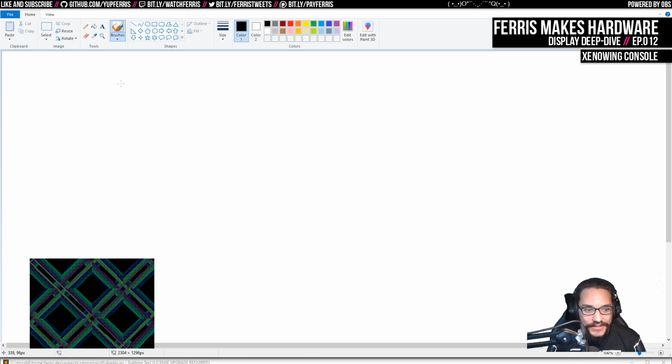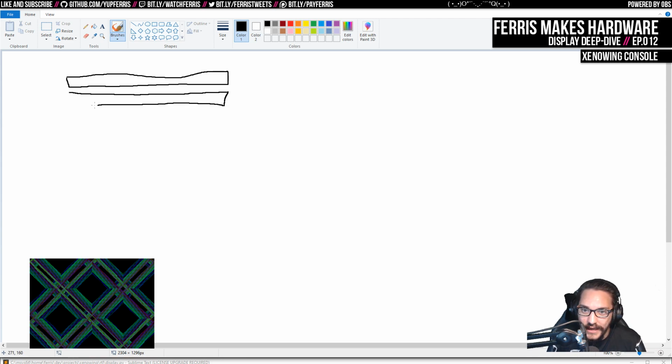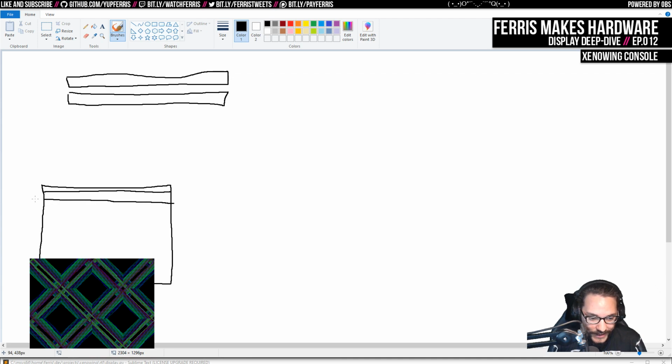So essentially what we have is 2 line buffers. And the other thing is, I'm still actually outputting 640 by 480. So in terms of the frame, we essentially need to output 240 lines, but we actually need to output 480. So what we do is we split each line up into 2 lines, like this. This is a great diagram, you guys. Perfectly representative. And so what we do is we dispatch actually 2 lines early. We dispatch the initial reads.